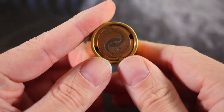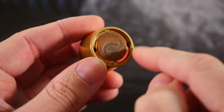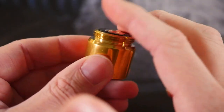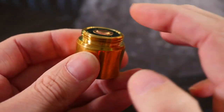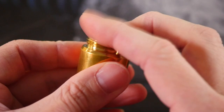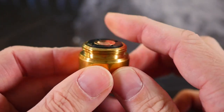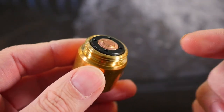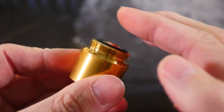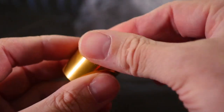As far as the switch goes, it is adjustable. On the bottom there's a piece of delrin. Let's take apart this switch right now. Here's the Omen mech mod switch — you can see the branding, they put a little GG on there. New Zealand made. Here is the delrin and the contact for adjusting battery rattle — it's reverse threaded. Counterclockwise sinks it down, clockwise raises it up. You'll need to adjust this occasionally for battery rattle, but generally I leave it in the same place for most battery and RDA combos.